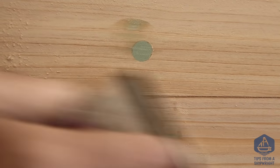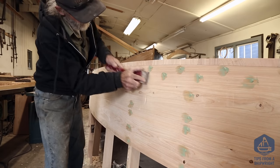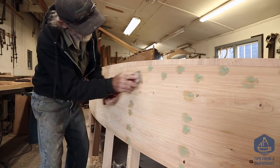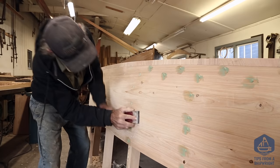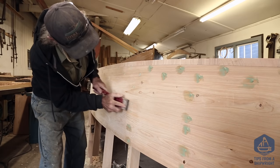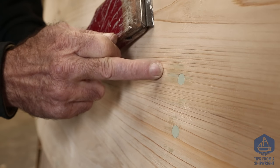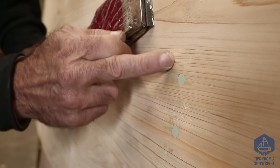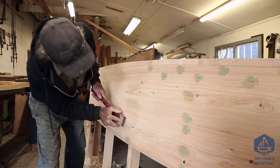I don't even try to get that last little bit of stain out of the wood with the scraper — you can't even feel it when you rub across it, but you can see a stain still involved on there. We're going to reserve that for sanding. We're just scraping our way along up forward, and those go real fast. There's still some stain in there, but not very much — it's like a pencil line buried down in the wood. I don't want to just scrape a big hole in it, so we'll get that out when we fair the whole thing.